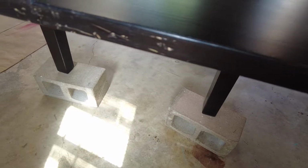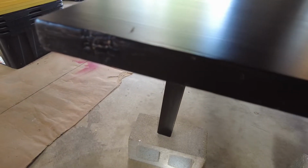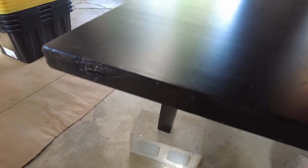Laminate furniture, IKEA is probably the most popular, has a glossy surface and paint will not stick to it. The good news is, if you use the bonding primer I recommend, you'll be able to transform your piece of furniture the easy way, despite those shiny surfaces.